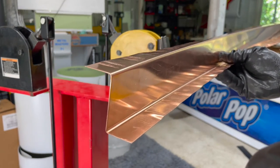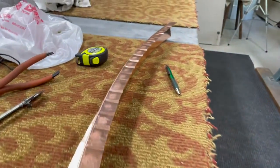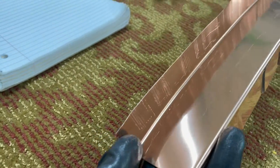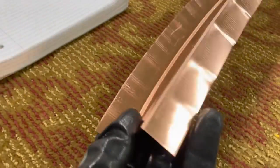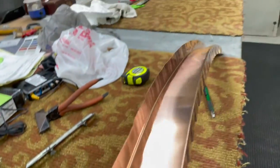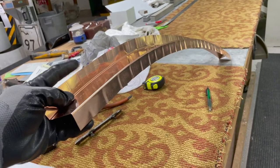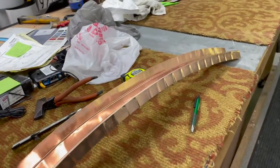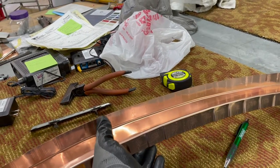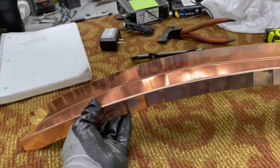Here's the finished product — just an experiment for the video. We bent about an inch up on each leg. You can't go too far when you bend those legs up because they won't fit in the stretcher or shrinker — the jaw depth is only so far. An inch seems to work well. It's got a pretty good arch: started out flat, did a series of crimps and shrinks on one side and stretches on the other. A contractor can install a window or door with an arch top and you just nail this over the door following that contour to flash it before continuing with siding.